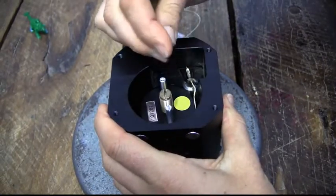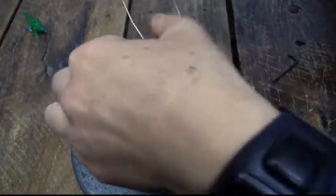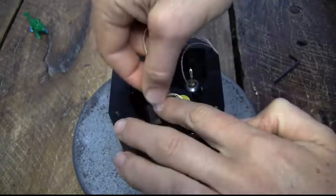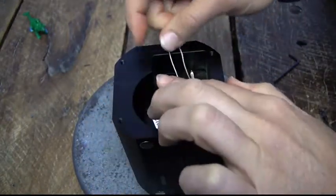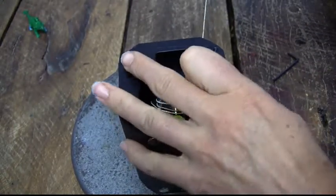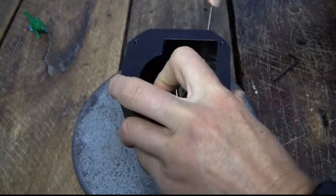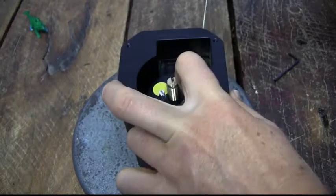Now, holding the tool with one hand and using the Allen key with the other hand, I'm going to pull the tether through and then in an anti-clockwise method wrap it 3, maximum of 4 times around these pins. Okay, and once I've done that, I'm going to manually turn it in an anti-clockwise method at the same time with my other hand pulling the tether, and this is going to actually wind it onto the spool. Okay, and then I'm going to let go slowly.